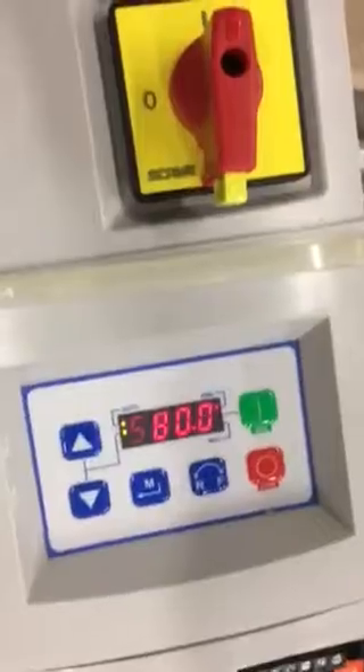You can see where it reads 80 PSI right there, in stop mode right now. The pressure has been relieved. I just opened up a valve to show that the pressure is gone. We've got some water in the cal column and a small pulsation dampener. This will indicate that we have no pressure in the system. We'll see if there's any pressure in the pulsation dampener — and that also shows zero.